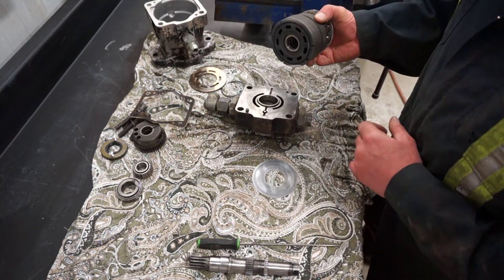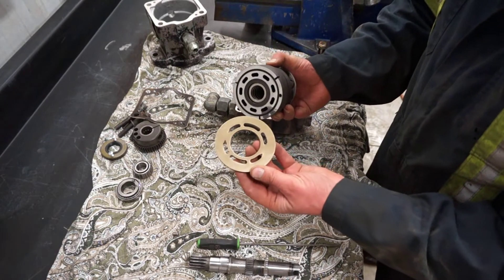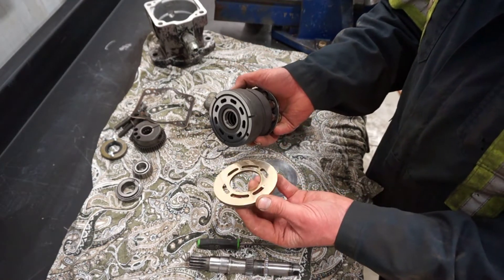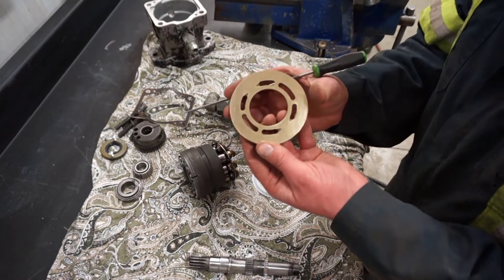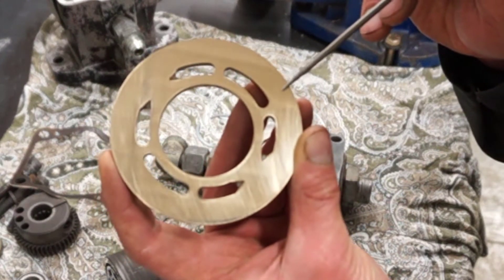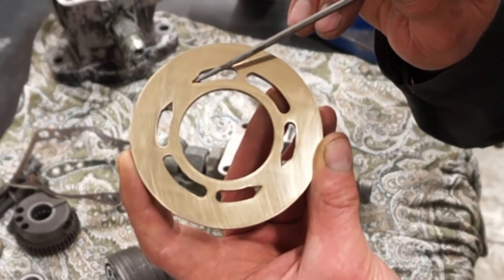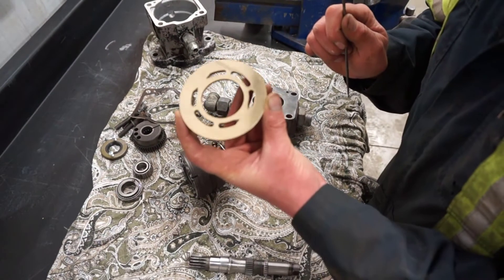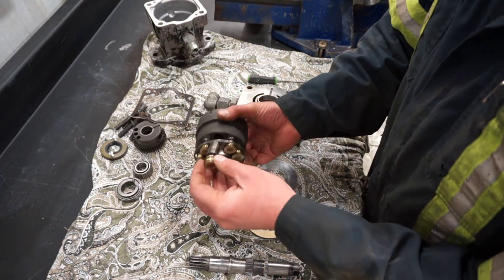Look at everywhere the component can leak — between the barrel and the valve plate. Those two sealing surfaces have to have a very fine finish. These two have been lapped; they weren't in all that bad shape but I hand lapped them to a fairly nice, near-mirror finish. The valve plate has a small pit from embedded material and one more from embedded material — I dug them out and lapped it. There's a very small amount of cavitation erosion at the edge of one fishtail, but not worth replacing. The plate cleaned up nicely.